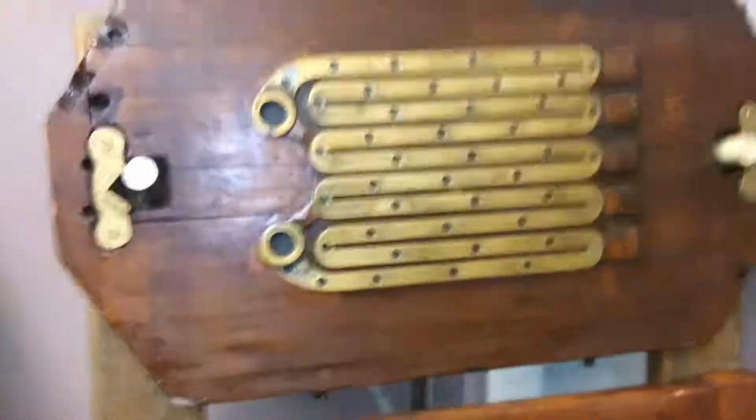Well, Steve, what's this board right here? Those are patterns for resistor grids. They make a bunch of those and use them in line with each other to take the resistance out of the motor. But I'll show you right here in the room. Here's a grid that's normally found on an L. They make a whole bunch of them, and they tap into different places on it and change the resistance in the motor.